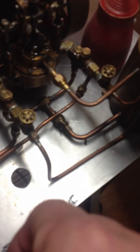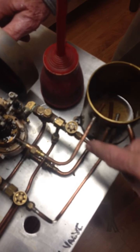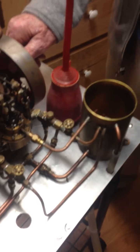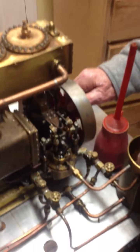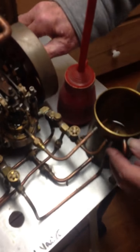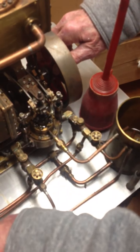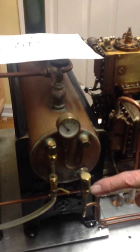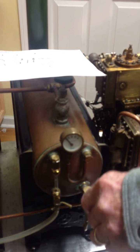If you shut them down, close them, it feeds the boiler. And if you open both of them, it just circulates through — it won't go that way. It'll go in through here, into here, and start filling this up from the water this is making. Because at sea they've only got salt water, so they have to get as much out of the steam, make it more efficient, get the water back and put it back in again. So that's the name of the game. And the steam pressure, until it builds up some pressure in here, the ball valve in here will leak a little bit, until the pressure pushes it down against the seat, and it stops leaking.